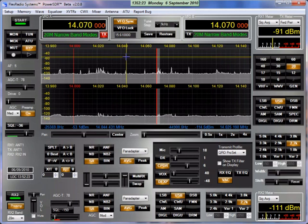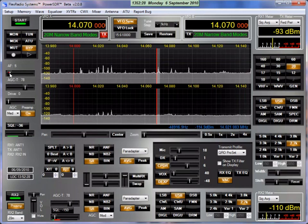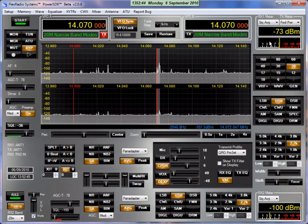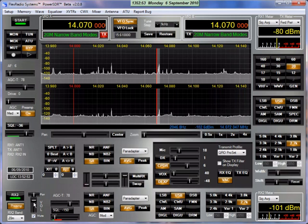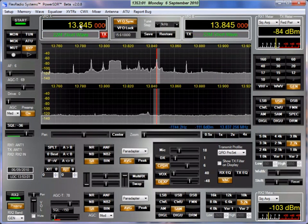Let's take a look at the PSK frequency. As you can see, arithmetically, there is something in the order of 23-24 decibels between the signal coming in on the Cobwebb and the signal coming in from the CHA250. Needless to say, at any given instant, the magnitude of signal present in either receiver will be a product of ionospheric reflection, multipath, and polarization skew. So what we are looking for here is a trend.